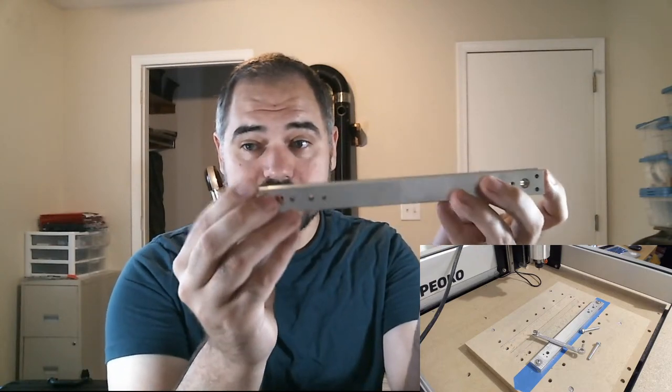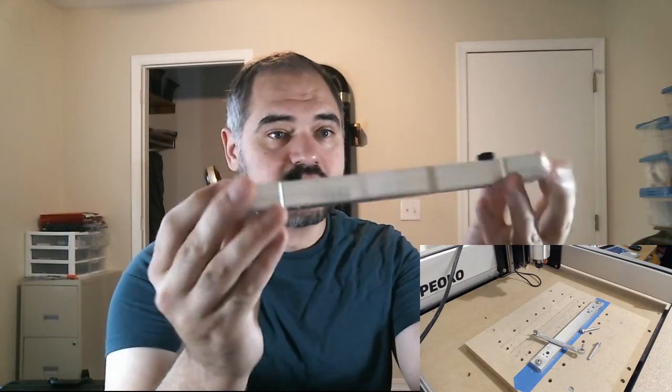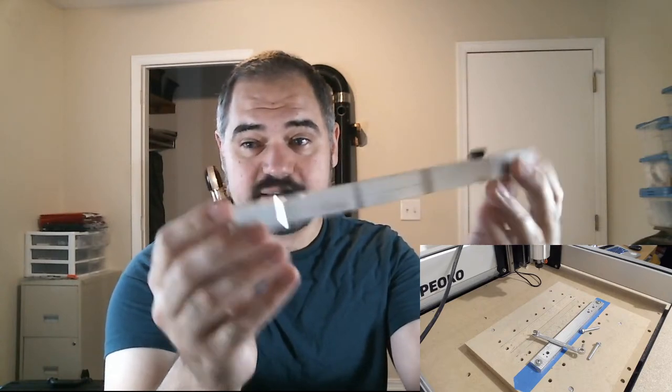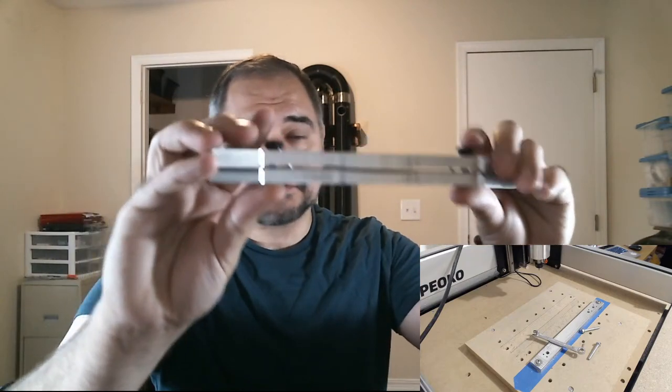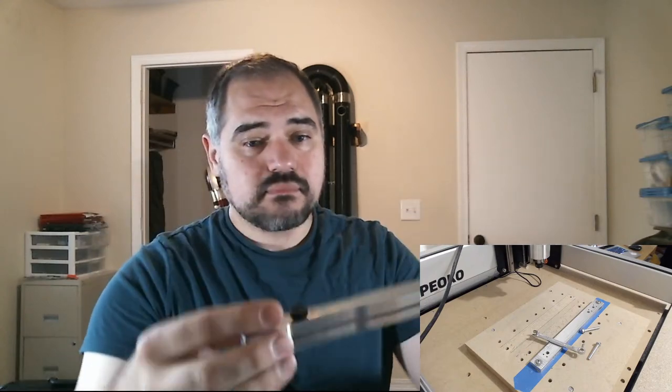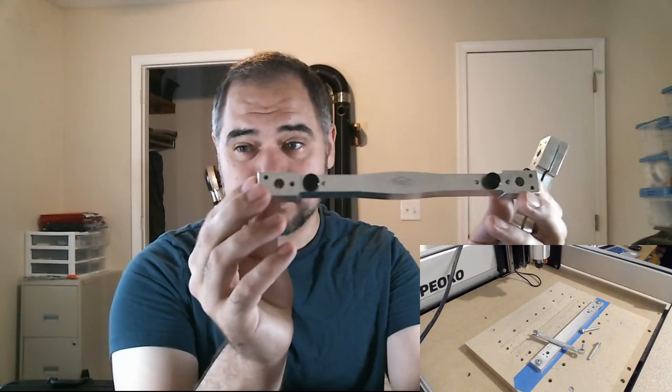But right now it's just a square, and I need to turn it into the shape of the reed. I actually have already done a few of these. This is my soprano crumhorn shaper I made last night. Now these are actually going to be a little bit different. You can see it clamps. There are these little alignment pins in the middle, and there are springs to make it easier to put cane in. And here is my tenor crumhorn shaper. And I've actually already made a sub-contrabassoon shaper. That's in a different room though, so I'll have to get that in a little bit.